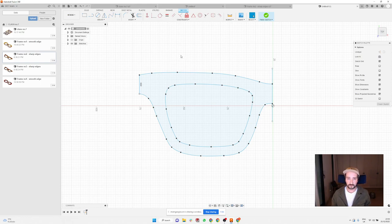And if I know that I'm going to make a frame that I will machine from both sides, I'm always creating my reference point on this first sketch. It's going to be the point where, when I do the first machining on the front, I'm going to make myself a little hole during this process. And when I flip the material all the way around, that hole is going to be my new zero. So I will know exactly where the center is and how to align the frame.